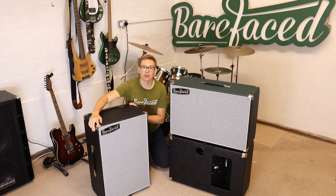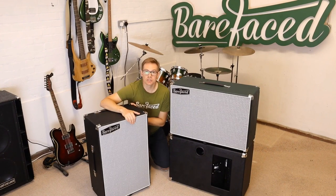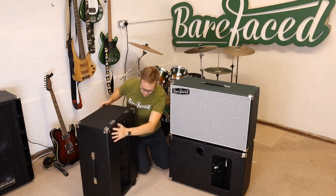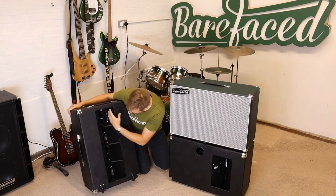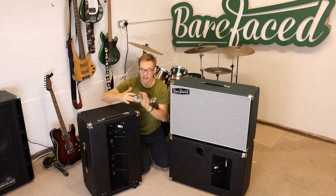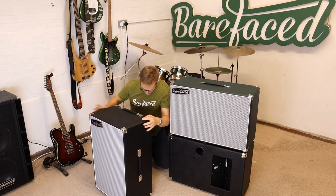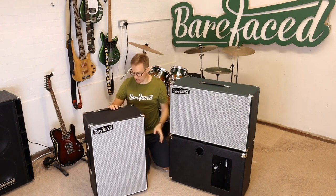Right, this one, the Uprising, is essentially like our single 12 cab, the Reformer 112, but vertically stacked, a pair of them in an enclosure, and consequently we've got the large AVD running top to bottom, because we can have the output from both speakers without them conflicting and causing a narrowing of lateral dispersion. So, more simple design really than this one. We don't have the extra crossover.